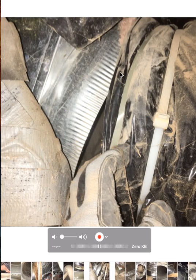When you go up there you can see it from the insulation — see the zip tie here and a zip tie here. There's nowhere for that stuff to bite onto; this isn't a very good collar. Because that zip tie wasn't on there proper and this one wasn't on there proper, it's peeled off — it's pulled back. So there's a lot of air loss right here. Had that zip tie been put on properly and then this all been gooped up with mastic, it wouldn't be an issue.